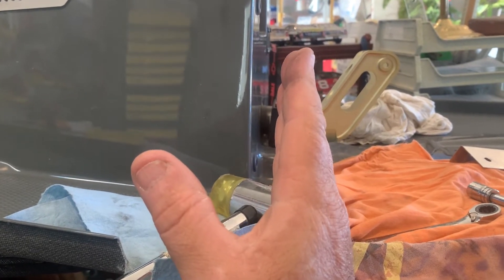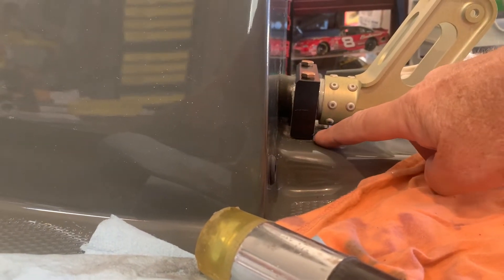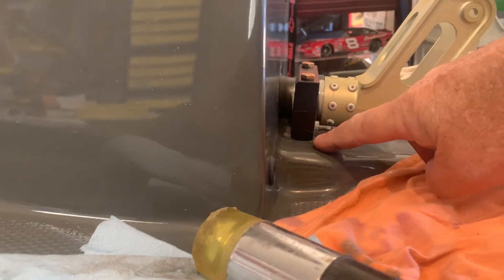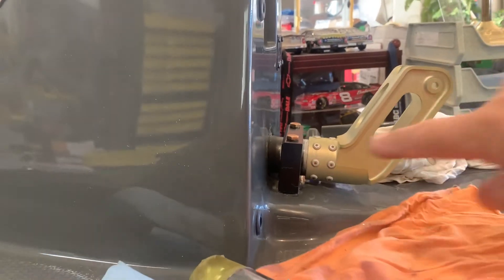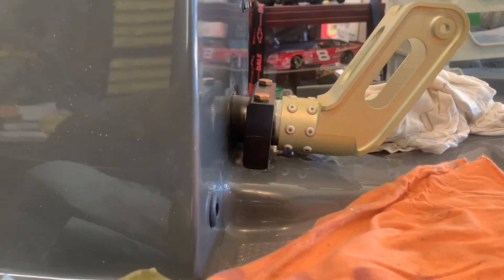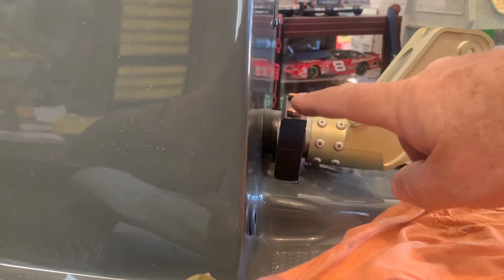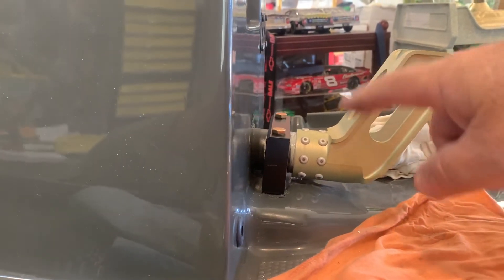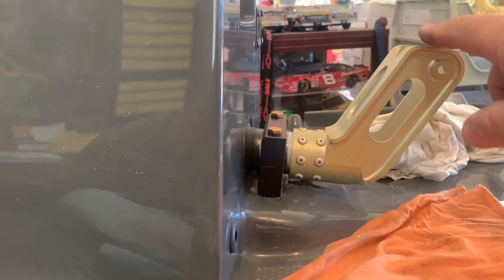What I explained in the forum post is that the front of these blocks — you need to sand this angle, or shim the back of it. It's the angle. You need to do this before you put the rear torque tube mast on, because you can't remove it and get underneath to reach this block once you've installed the rear mast onto the torque tube. So try this out on the bench first. Put these blocks together, torque them to 90 inch-pounds, and see if it moves good. It will most likely. If it doesn't, sand it out a little bit until it does move nice and smooth.